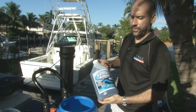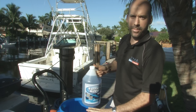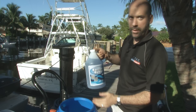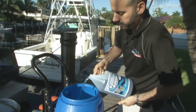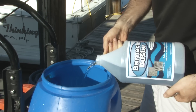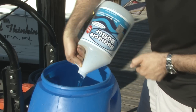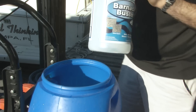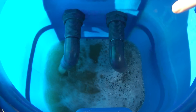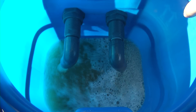The dilution ratio of barnacle buster concentrate is four to one, whereas one gallon of concentrate will yield five gallons of ready-to-use product. For a C18 Caterpillar engine, we already know that one gallon of concentrate is more than enough to do the application. We've ensured there are no leaks and now we're ready to just pour it in. The product will immediately start to mix with the water and will immediately start working as soon as it comes in contact with the marine growth. As you can see, immediately the barnacle buster solution is changing color — it's gone a very dark brown. This is an indication that this engine is in need of cleaning. You can see the foaming as the product goes to work.